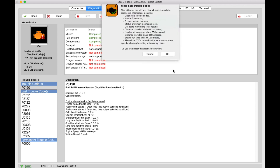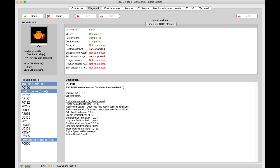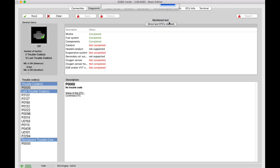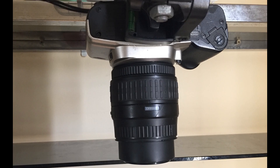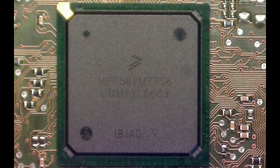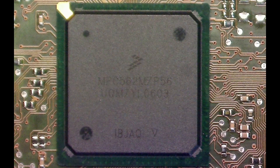Later on when we talk about repairing and testing the ECU itself, we'll go into this connection sequence in much more detail. An important tool when repairing PCBs, especially ECUs, is a microscope. In my case I've adapted a Pentax film camera and fitted a digital sensor from a web camera. This has the effect of giving a very narrow field of view, probably only a few degrees, and by mounting it above the ECU that I'm working on I can examine the circuit board in great detail.